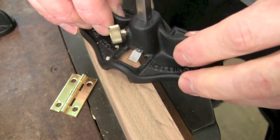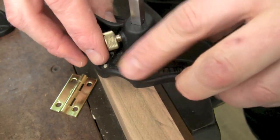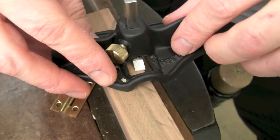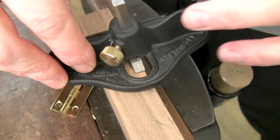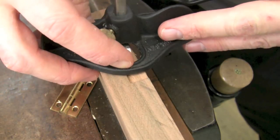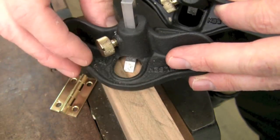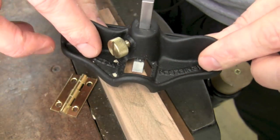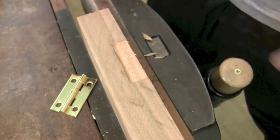The difference with the open throat router is you can see ahead a little bit better, but you're not getting good reference anywhere across where that hump is. Especially if you turn it to the side, it's really easy to tip down, whereas the closed throat doesn't do that. Once the closed throat is sitting on the reference surface it won't tip nearly as easily, and that's why the closed throat on these skinnier pieces of wood is really nice.